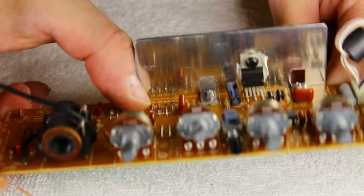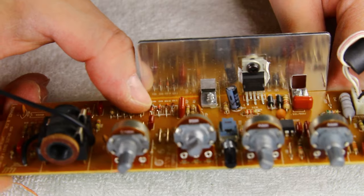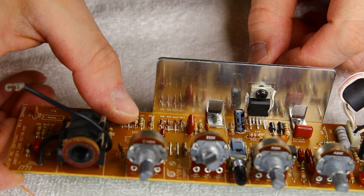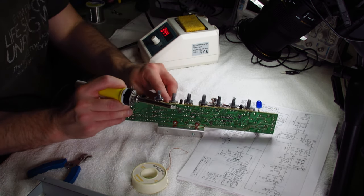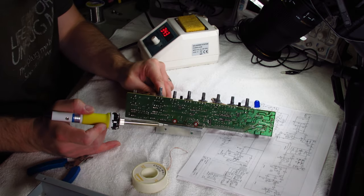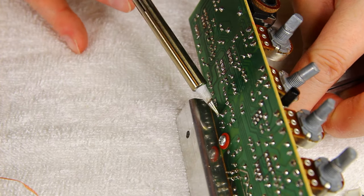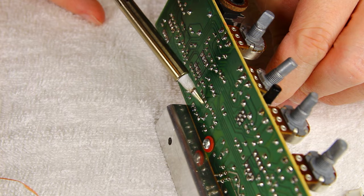The other components I want to remove are these diodes. As you can see they're also silk screened for orientation — the cathode is marked with a band, so negative is the banded end, positive is no band. What I'll do is just pull those out as I heat them, pulling them out with tweezers. Grab onto one end, make sure you're on the right solder pad, pull it out. I'm going to save these to demonstrate the forward bias voltage later.